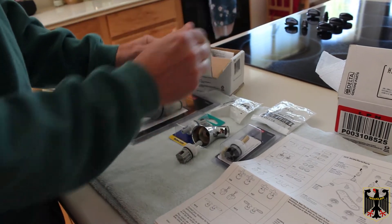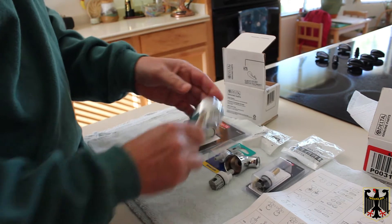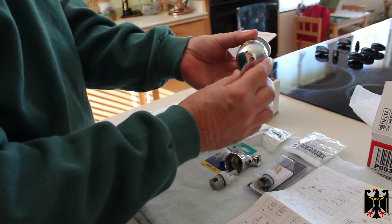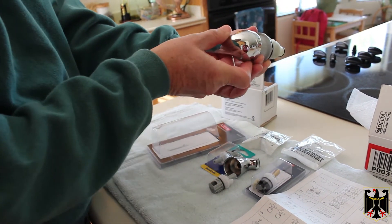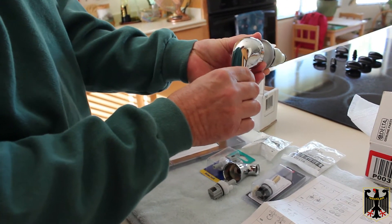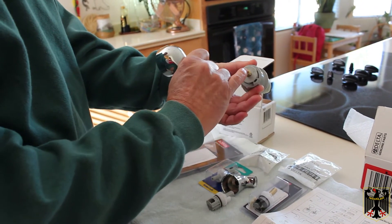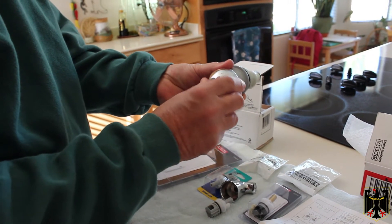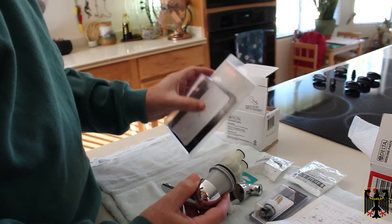The one that's really been the mystery for most people is these shower handles. The shower handles fit on like this — they're keyed, you can see inside there. It goes on like that, and when you tighten the set screw, it should be nice and tight. A lot of times you'll find these are loose, and it's not necessarily the set screw. What happens is this brass gets rounded out and this casting gets rounded out, and what you really have to do is replace both pieces.